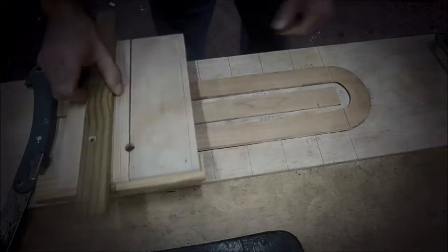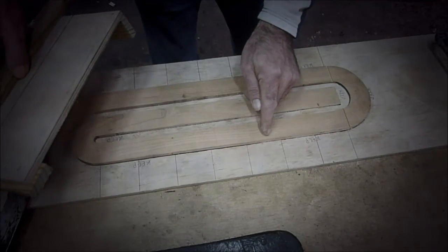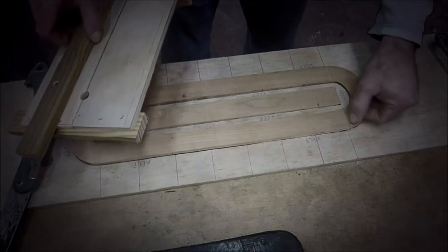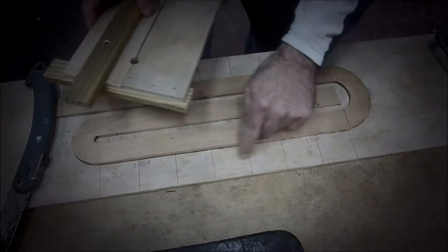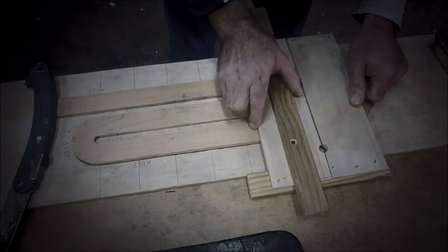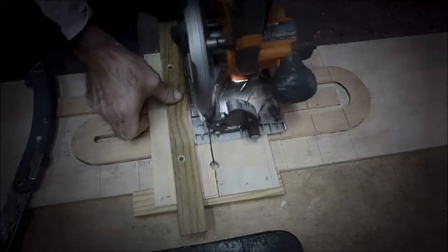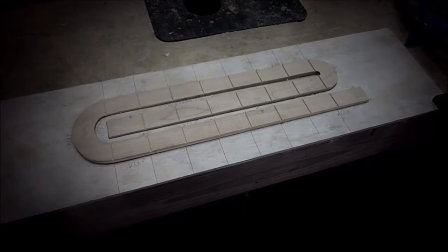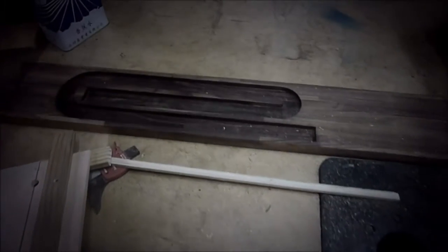So the next thing to do is I've got to make 7 sections that are divided with 5 hole positions each. And the lady would like me to inlay a darker wood there, so I made this jig. Pink lines are where I want to notch, and that little window there allows me to see where they are. I want to get those inlays in before I inlay that S-shaped track thing into the destination piece.